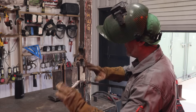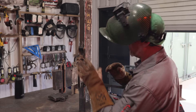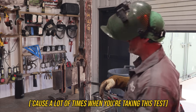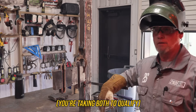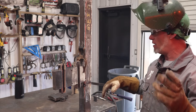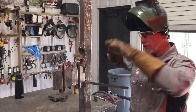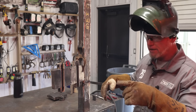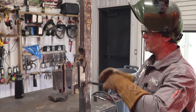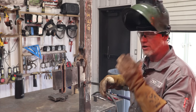Now it's too hot — you're just going to waste material, smear things into the weld, and it'll start blowing holes. That's when I take that and move to overhead and stay efficient and working — stay in a rhythm. Because a lot of times when you're taking this test, you're taking both positions to qualify. In order to be qualified in all positions up to 24-inch round pipe and all that, you do the one-inch unlimited in a 3G and a 4G, and now you're covered in that entire gamut — the 3G and 4G cover all F positions, so when you get out into the field you can be efficient and effective because you're not limited.